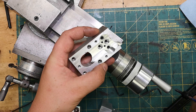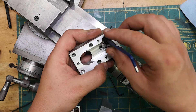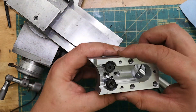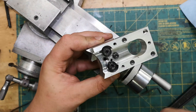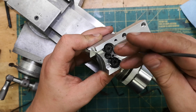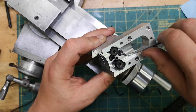We can now switch over to assembling the actual drive assembly. Note that while I am assembling this for the first time on camera, it will be taken apart again so loctite can be applied to the fasteners, the dowels can be installed, and I can run the wires to the fabled electronic components. The first thing I'm doing is installing the track rollers and verifying that they rotate freely. Next, I can install the fixed half of the dovetail with two M4 screws. I'm tightening the screws firmly for now, but when the compound feeder is aligned, I will ream the dowel holes and the dowel pins will take up the majority of the applied forces. This joint will be pulled in shear because of the belt tension, so the dowel pins are going to be really helpful to prevent the joint from slipping.